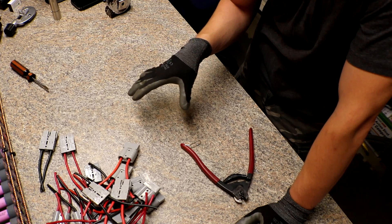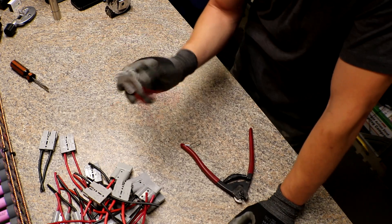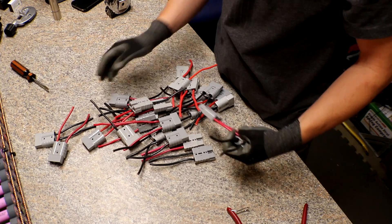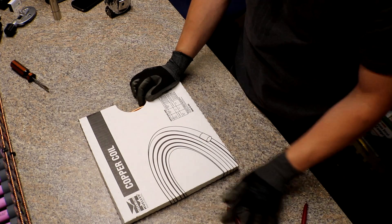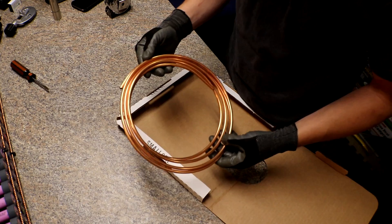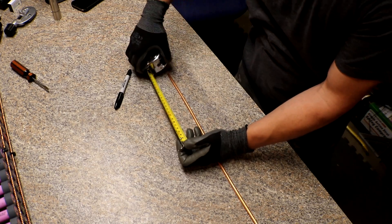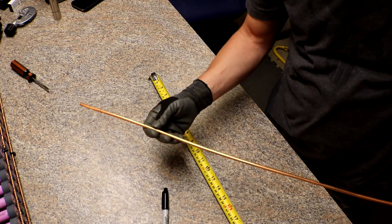The end batteries connecting to my APC UPS system need a blue terminal — the internal part is the same, I just have to put a blue one on the end. Now that I have all of these cut up, I need to make terminals to put on the batteries themselves. Since I don't have any 10-gauge ones, I'm going to make a whole bunch of homemade butt connectors out of this copper pipe I bought a couple years ago. A one-inch butt connector should do it — I have about 20 marks on here and I'm going to cut them off.